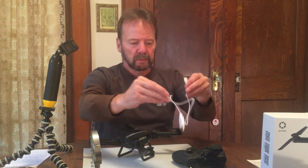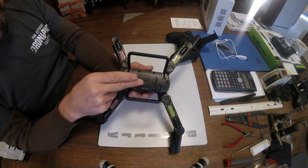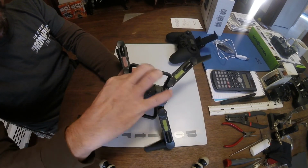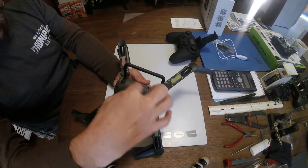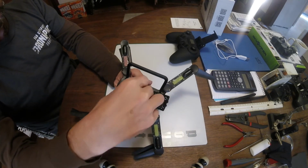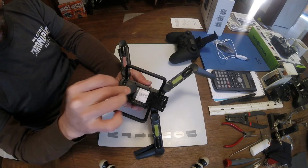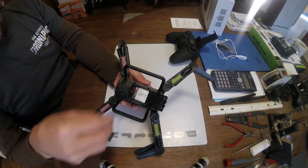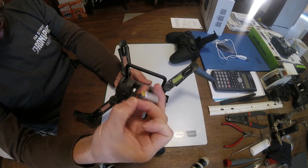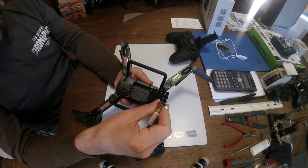And conversely, as tight as that connection is, as time has passed, now the connection here is a little loose on the bottom of the drone, and if I open this up, you can actually see that I keep a little electrical insulator here, a little spacer in there to keep that connection tight with the battery so that I don't lose the connection there.